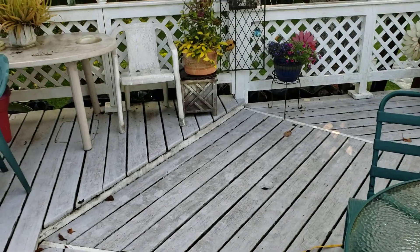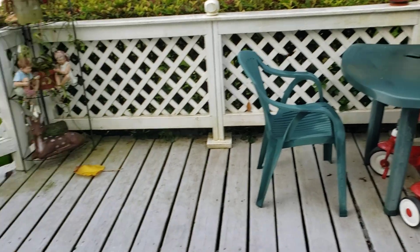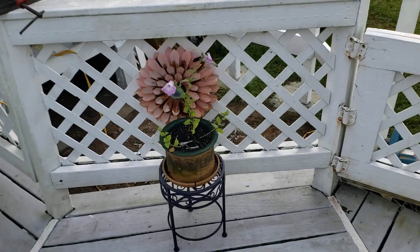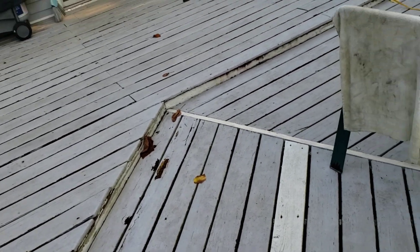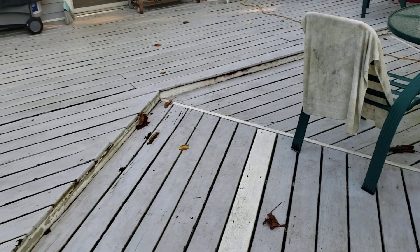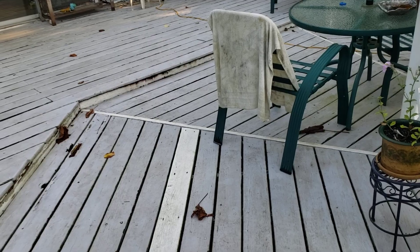Aside from needing a power wash, I painted about every three or four years. I use a spray painter on the lattice — that's the quickest way to get it done. One of the tricks to keeping the deck going is: don't go bare wood. Seal it up good as soon as possible, then reapply sealant every three or four years.